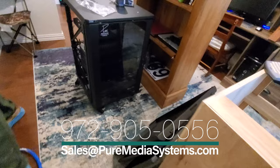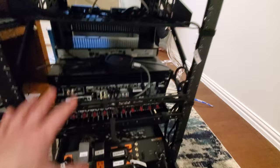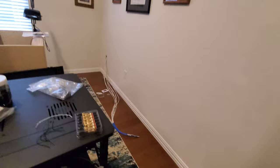Got everything labeled in the Wattbox. Got the Denon 3700H. We've got RS-232 serial coming up and around, going to the Control4 EA1 controller, so that we've got a nice two-way feedback with that as well. This is the wireless transmitter for the Mega D subwoofer, Roku Ultra, and of course, you've got our switch right there, and fans. So the FS series racks do come with ventilation built in. So we're going to get to work and finish putting everything up.